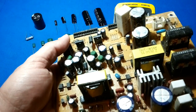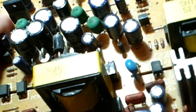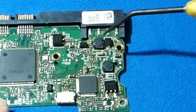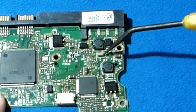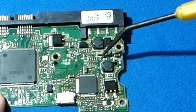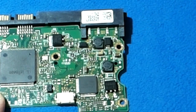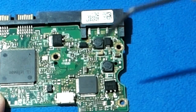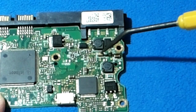Another example: take a look at these suspicious capacitors. There is a chance that a capacitor that has suffered from heat can go into short circuit. Sometimes one side touches ground and the other continues its function in the circuit board. There is also a chance it is in parallel with something that is in short circuit. One technique to find out if a capacitor is in short circuit is to use a multimeter set to continuity with a beep.